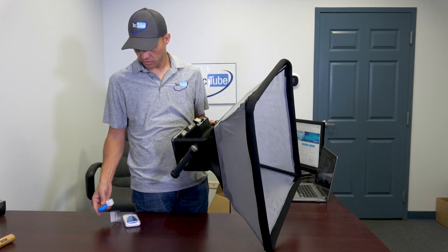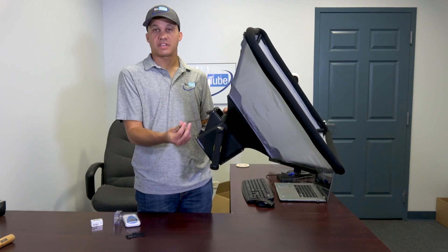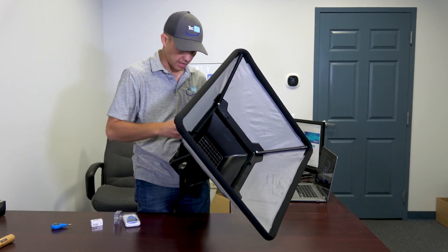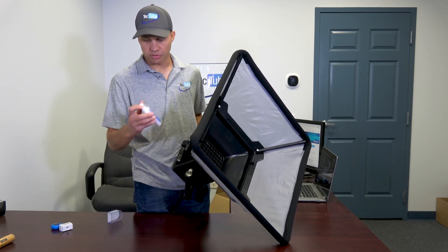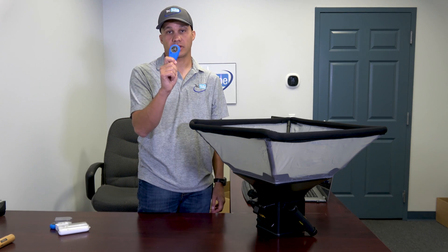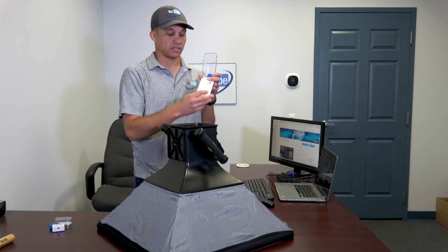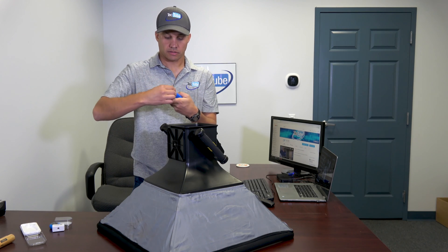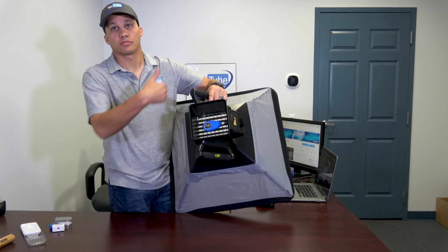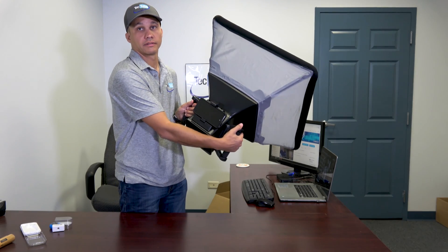If you're using the old plug-in style — hopefully you're not, because that's pretty outdated at this point — you can open this cabinet up, and there'll be a cord that feeds into your phone while the sensor plugs into the other end inside the hood, acting as an extension cord. We're not using that today. We're using the Bluetooth one. You can buy this hood with or without that accessory. Here at TEC we sell it without, since almost all of you already have one of these sensors and it doesn't make sense to buy another. There's also a small audio-jack-style device that screws in and plugs into the hood here, placing the sensor in the airstream through a dimension that's already known.